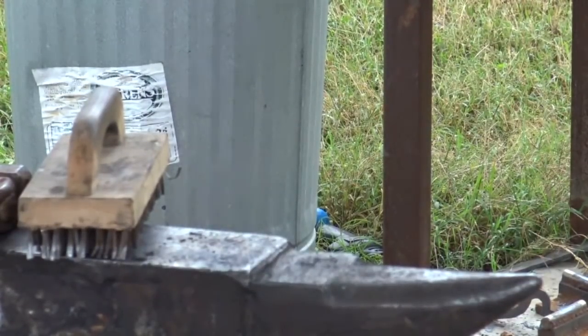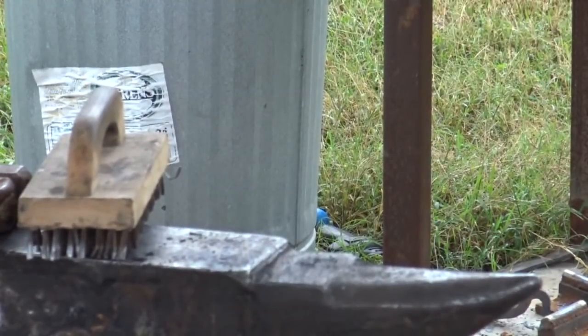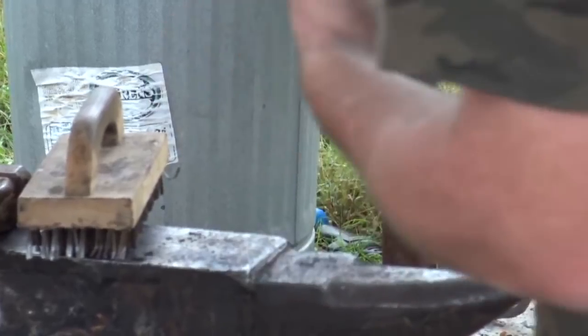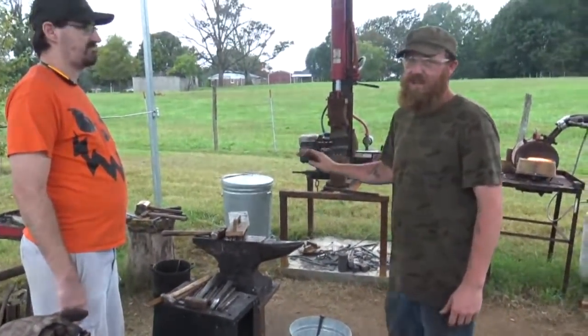Don't overdo it. Just because I got it pressed doesn't mean I can just smush, smush, smush. Yeah, it's done. I still got to abide by the heat rules, you know? Some things people don't know about presses, guys. That thing's a giant heat sink when you're doing Damascus.